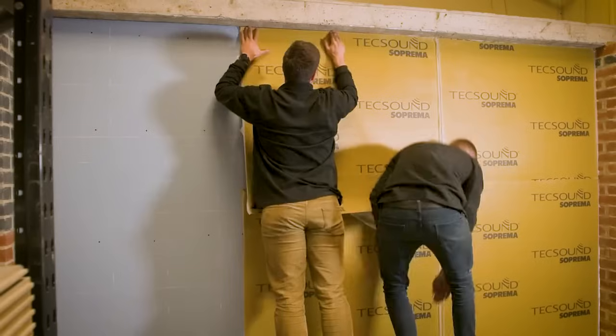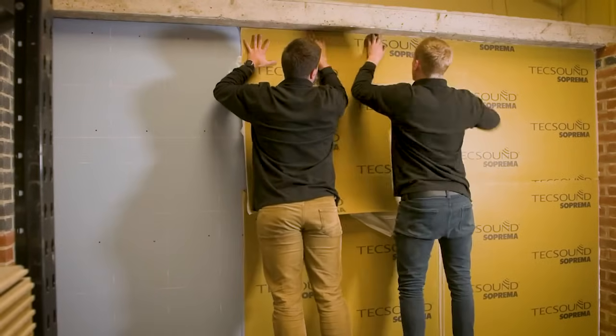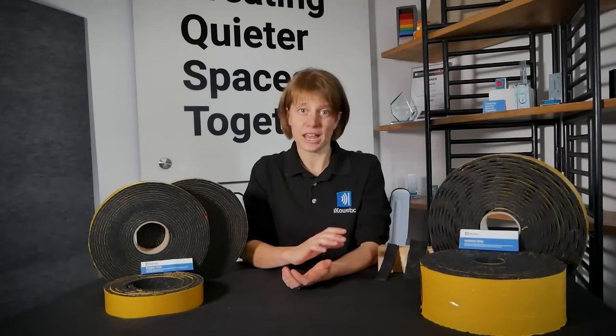So a good example would be someone walking across your floor, the vibrations travel through the floor and then could travel up through your new wall. By resting the new wall on an isolation strip, however, we're going to decouple this structure and resist the vibrations. Your wall soundproofing is going to be greatly improved by taking this extra care.